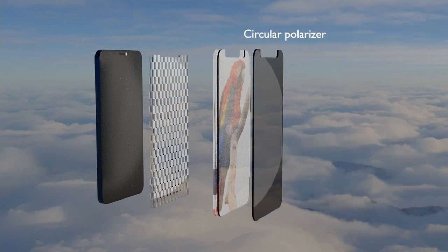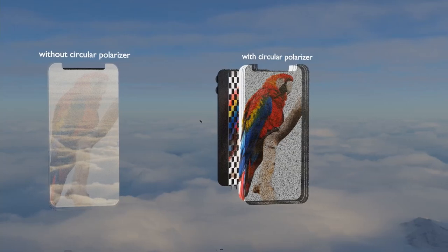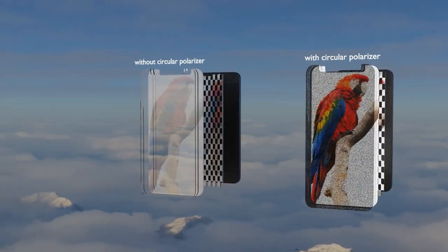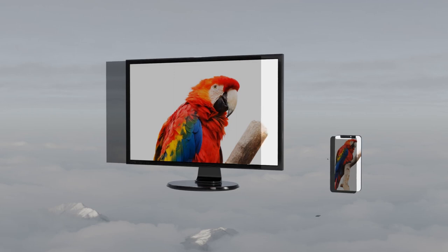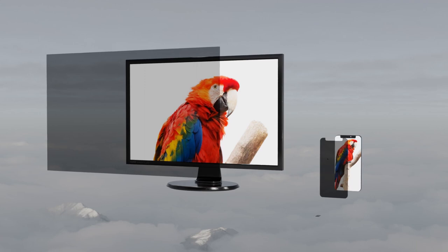It is in the form of a black translucent film, and when it is mounted on the outermost part of the display, it has the characteristics of making all the light incident on the OLED from the outside be absorbed when it is reflected by an anode material. In short, it is a film that blocks the reflection of external light. Not only mobile phones, but also OLED TVs have it installed in all OLED displays. Because of these features, the display can be viewed clearly even in bright environments.